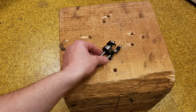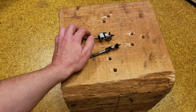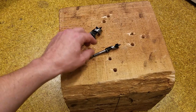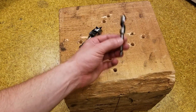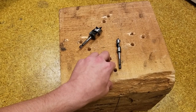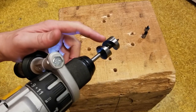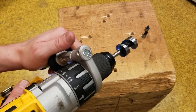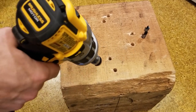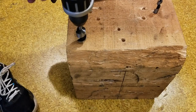I have the half-inch bit and the one-inch bit for testing. I'll run the one-inch bit in the regular drill to show hole finish more clearly, and run the half-inch first with the impact driver and then with the drill to show the performance difference. I'm going to run the one-inch at 1200 RPM — a much more appropriate speed than 2000 and a more honest test anyway. These things look pretty decent — let's see how the one-incher does.